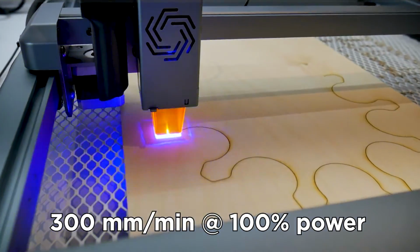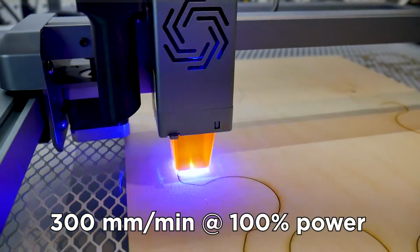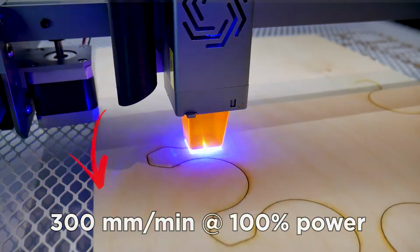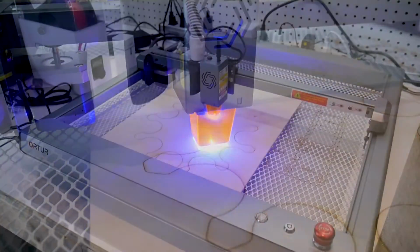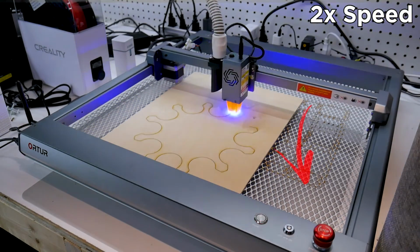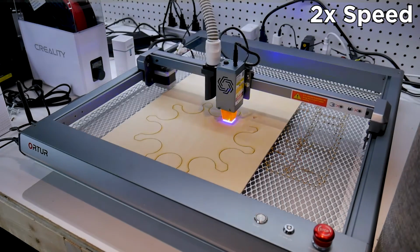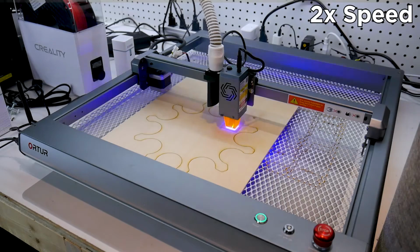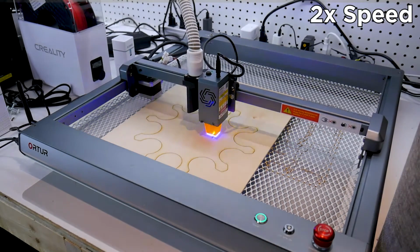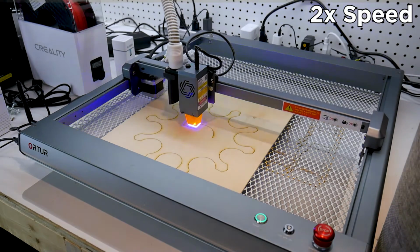Now, the second thing, which is a little harder to see, is the gray silicone mat sitting underneath that work table that I just mentioned. I use this mat on all of my open frame laser cutters that sit on top of my work tables, and this protects the table from getting burnt from the laser that passes through the workpiece. The silicone mat can withstand really high temperatures, and by the time the laser passes through the workpiece and then down through that memo board that I just told you about, the beam itself is quite diffused and it will not cut through that silicone mat.